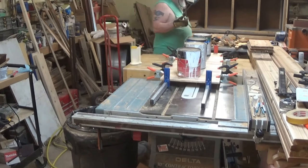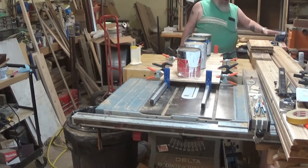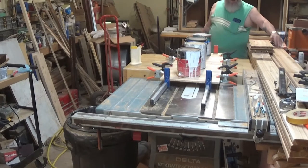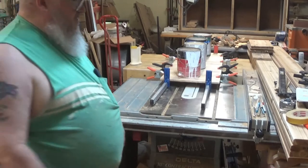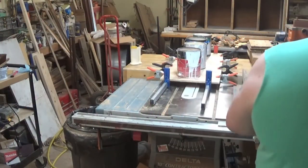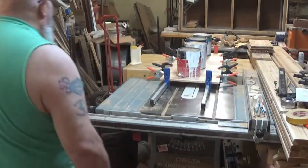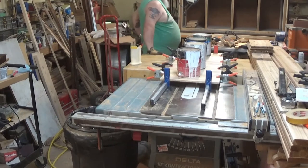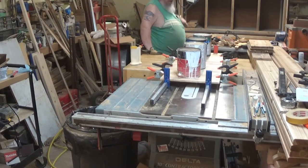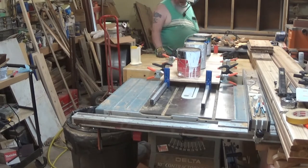For the 2 5-inch drawers on top, I won't need to go through this. I'll simply cut one piece. I'll cut a 16-inch piece of cedar, rip it. They'll be wide enough. This is over 5 inches and the drawer's just under 5. Yeah, these are 5.5 inches wide, so that's plenty. And one piece can make the drawer fronts for the 5-inch pieces. And still, I'm gonna use these little pieces back here for the inside of the front.